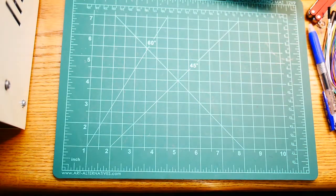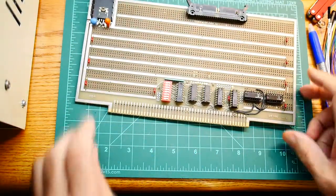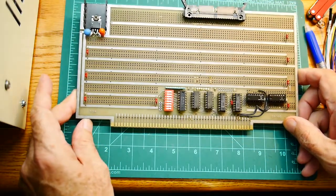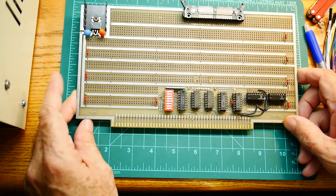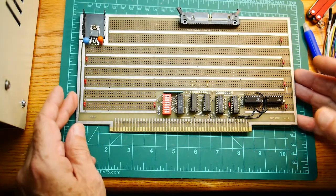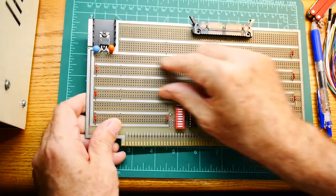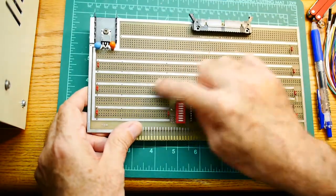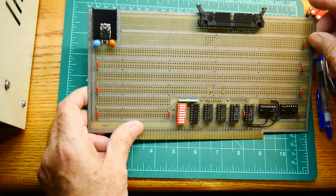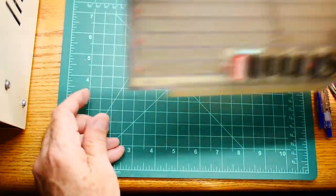So I want to connect up the SSI 263 chip, and we're going to use this board. This is my Centronics interface, and I'm never going to hook that up, so I will reuse the board. The nice thing about this board is it has a lot of the circuitry that we're going to need. Since we have so much room on this prototyping board, we'll put the 263 chip and then we'll also add an audio amplifier. We'll just have to hook up a speaker to this thing. We'll use an LM386 chip for the audio amplifier.